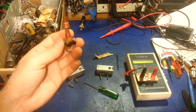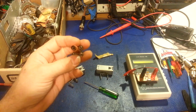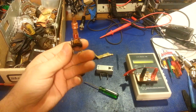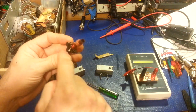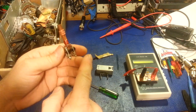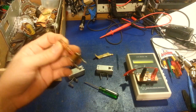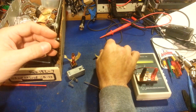I've pretty much convinced myself by seeing what type of transformers and coils they're using that there's probably nothing wrong with these double-tuned transformers. This is the reliable kind — not the ones where the capacitor is built into the base. The capacitor relevant to the transmit circuits is an NPO-rated ceramic, so I'm going to say it's probably not the problem.